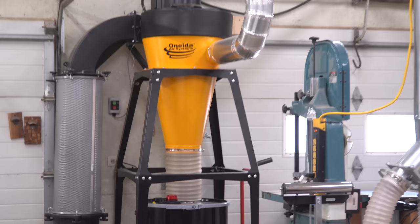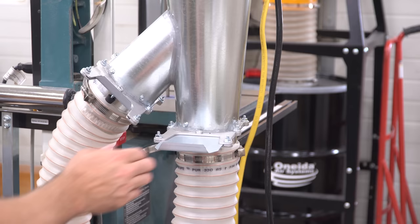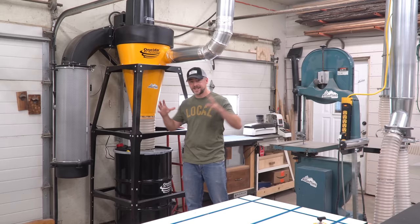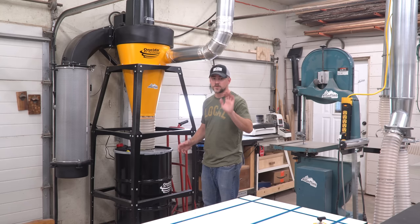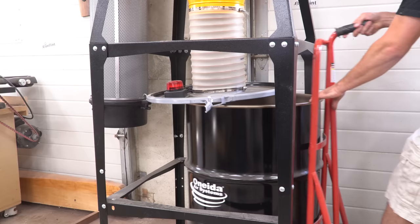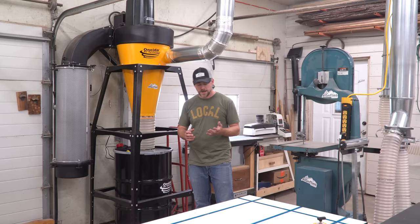It's not just a dust collector — it is the whole system. Plumbing runs all the way across the shop, starting with six-inch pipe and tapering down where the tools need different types of airflow, blast gates, and flexible hoses that are rigid so the horsepower in this doesn't collapse them. We have a 55-gallon drum for storage as opposed to a 35-gallon garbage can with my old system — almost double — so I can get close to twice the work done before I have to empty it. All I have to do is take the ring off, roll it outside, and dump it in the tractor or haul it off with the dolly.